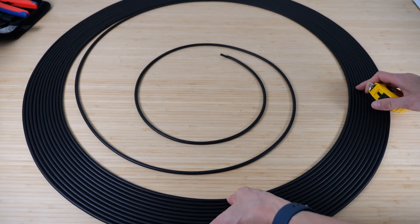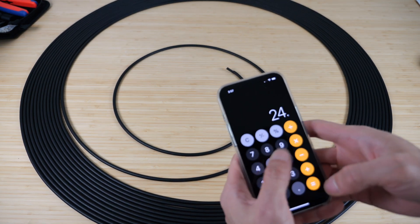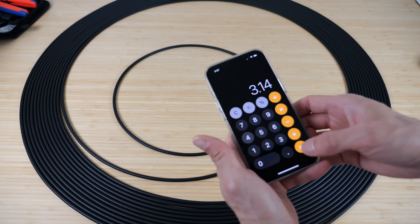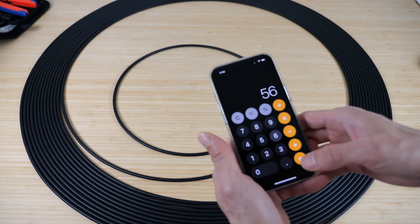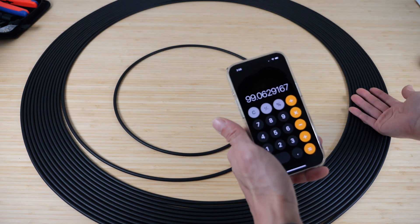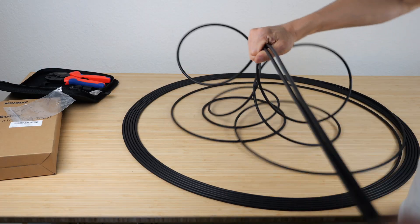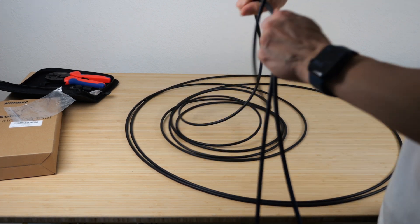I got it rolled out somewhat large. Measuring 31 and 24 and a half inches in diameter. 31 plus 24 and a half, divided by 2 — this is the average diameter. Diameter times pi is circumference, times 13 circles. And then we add 56 inches, divided by 12. So we got 99 feet. Probably just off by a foot from my calculation since it's not exactly circular. But it's close enough. I'm just going to grab a pair and find the midpoint here, so I get 50 feet exactly.